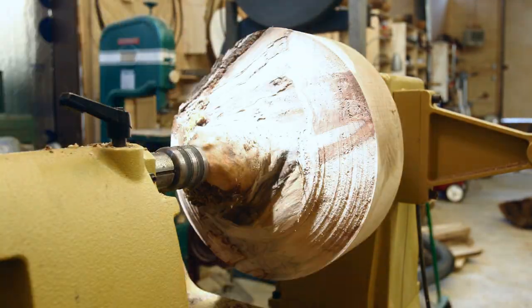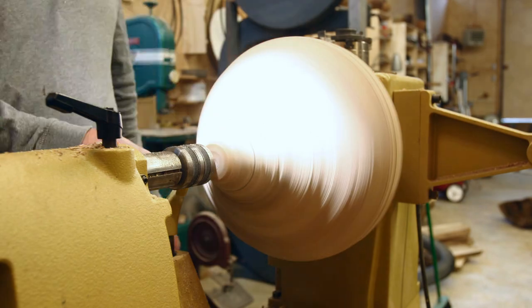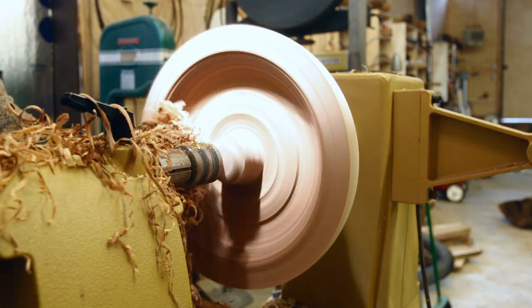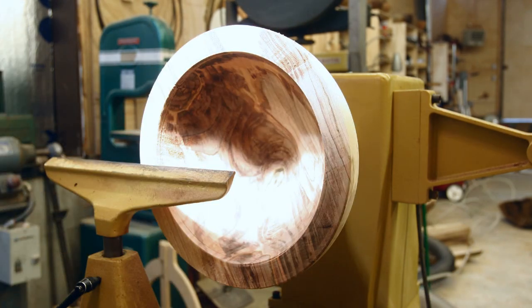From there I could turn the piece of maple into a rough bowl on the lathe. This is still green wood so it turns really easily, and it's nice to turn it to a bowl shape at this point when it's easy to cut and then let it dry. When it's partially formed as a bowl it will dry a lot quicker — about a year from here, not a decade if it was still a log.